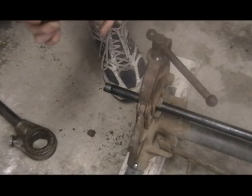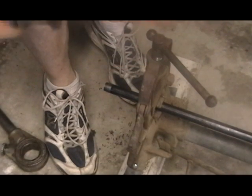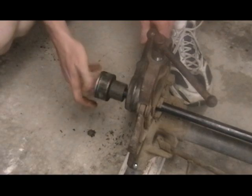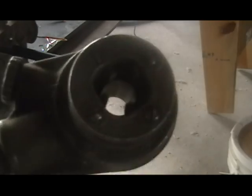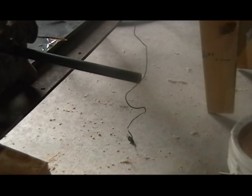When you're putting the die on the pipe, there's going to be a solid part where the pipe's diameter is — that goes over the pipe first. It functions as a guide, and then when these teeth cut, they're cutting basically perpendicular to the pipe with this guide in place. Slide your wrench over first, put the guide through. This is already partially pre-threaded. So we're getting ready to thread this pipe on a kind of awkward stand here which isn't secured to anything, so we've got to hold it steady. We've got the dies in the center — you can see them, four on the edges. I'm going to put some WD-40, some kind of lubricant, for cutting purposes and also on the pipe. We're going to continually reapply lubricant.